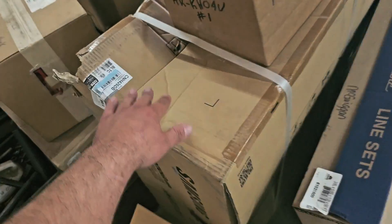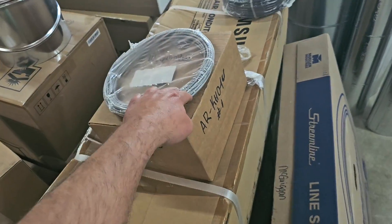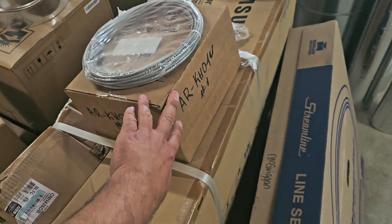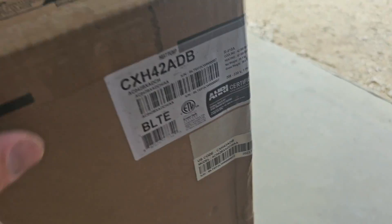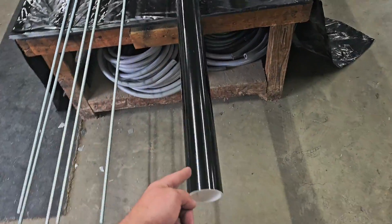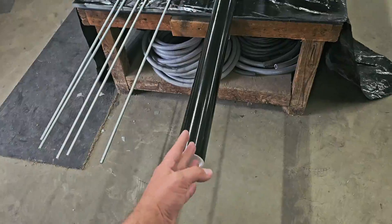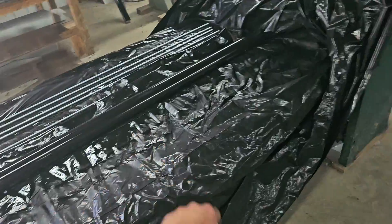I'll show you a little bit of the progress day by day, and if you have any questions about the install, the sizing, or the equipment, let me know in the comments. Here's the box containing the 360 ceiling cassette, three-and-a-half ton, communication cable, power cable, line sets, and controller. We've got the outdoor unit right here — three and a half tons, C42. We're painting the all-thread, unistrut, and three-inch PVC so we can run the line sets inside the PVC and hopefully the drain as well, just to make the job look much better and nicer.